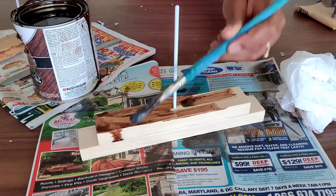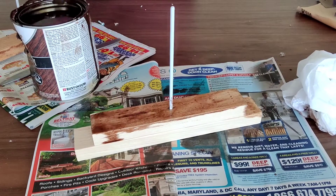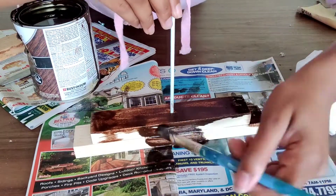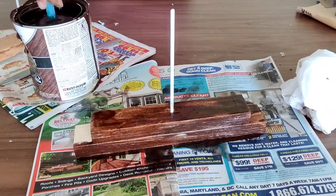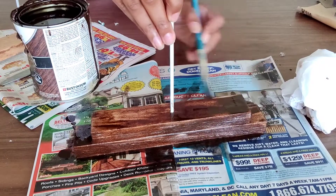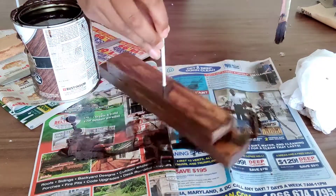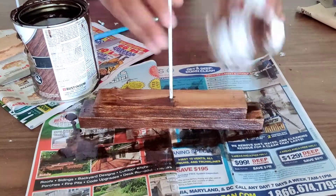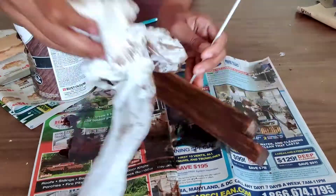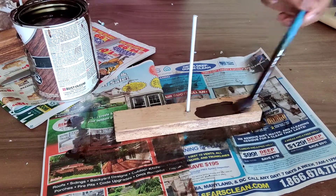Finally we get to the fun part — the staining. You couldn't mess this up if you tried. Make sure you're brushing in the direction of the grain and shake your stain up before you start. Coat all visible areas and the bottom if desired, just be sure to avoid your white metal leg. You really should stain before adding your white wire, but it's very easy to clean if you didn't. Find yourself an old rag to wipe the extra stain away. I wasn't willing to use any of my good rags so I just used tissue paper — it worked fine. I didn't worry much about staining the bottom.